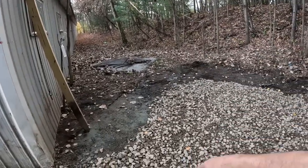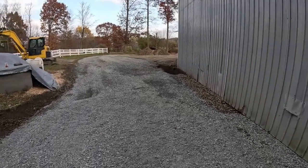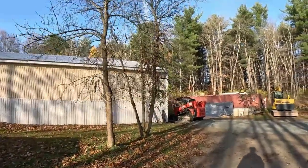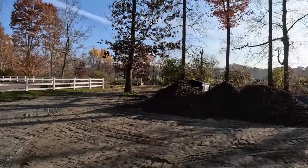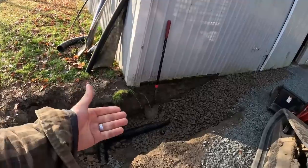In the future if we want to grade this we could probably put in a shallow French drain and get that pipe getting more flow. We stayed two foot from the building even though the stone is three, just for the horse footprint. Tomorrow we'll do the full three feet all the way out front because horses don't go out that way. One more day and this place is wrapped up - 500 foot of pipe looking good. I've only got a day and a half in it. Tomorrow we go here - two trees have to come down, fire up the Komatsu, knock them down.